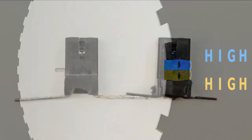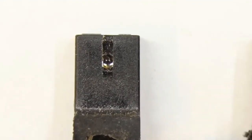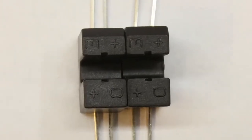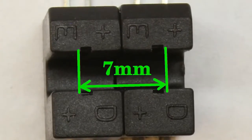Let's have a closer look at the sensors. The light emitting and sensing areas are limited to a slit with a width of just 1mm at the center of the device. With the sensors being side by side, we can reduce the tooth width to a minimum of 7mm, resulting in a disc diameter of just 13cm.